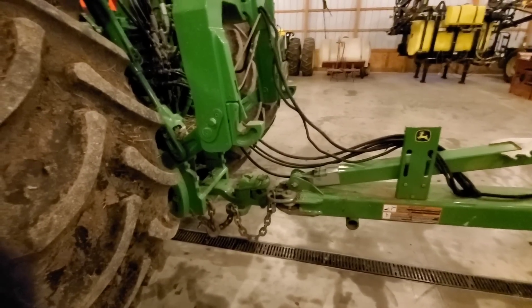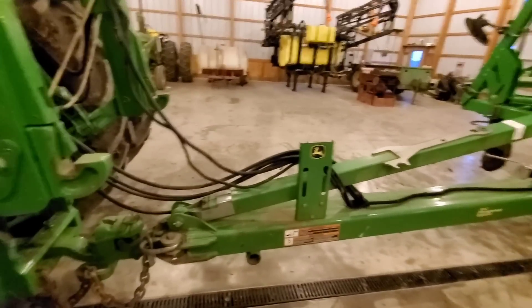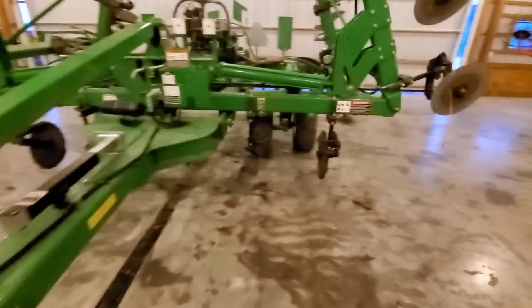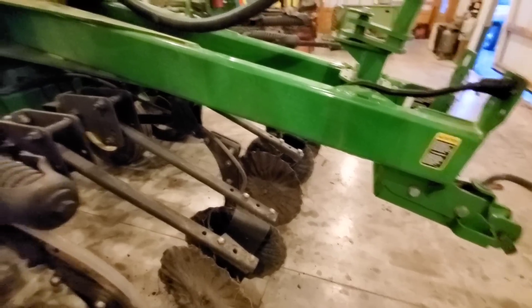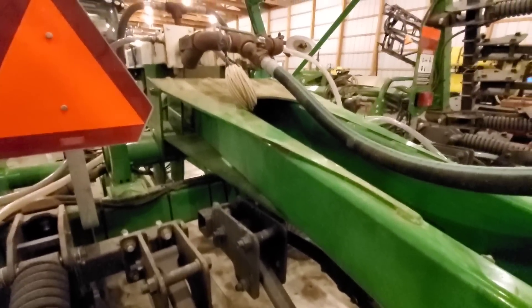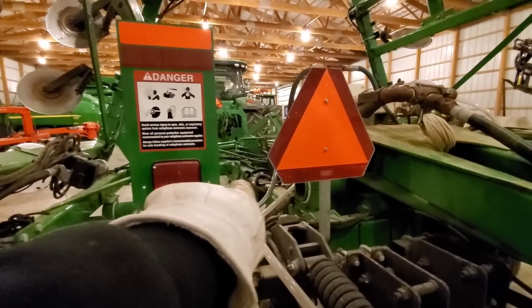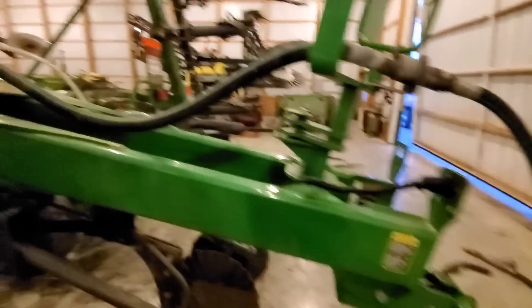I never liked the front cart. It was on this long hitch so the duals could turn inside the hitch, but you couldn't see your toolbar at all. They had short hoses that bent a lot with long pipes, and it wore everything out. With the rear cart, the hose layout is far superior. So we're in the process of redoing this Raven system — dual super coolers, dual tank hookups. All this will come off, and there are some bolt-hole mounts up there where two big frame rails will stick down. This hitch all comes off and the big hitch goes out the back and hooks onto the dry cart.